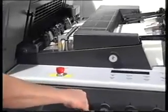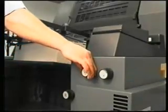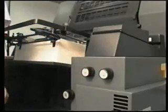The angle of the suckers relative to the surface of the pile depends on the printing stock. It is adjusted to the material in question using the rotary knob. To prevent double sheets being sucked up when using thin papers, the knob or the sucker bar can be adjusted to reduce the volume of suction air.